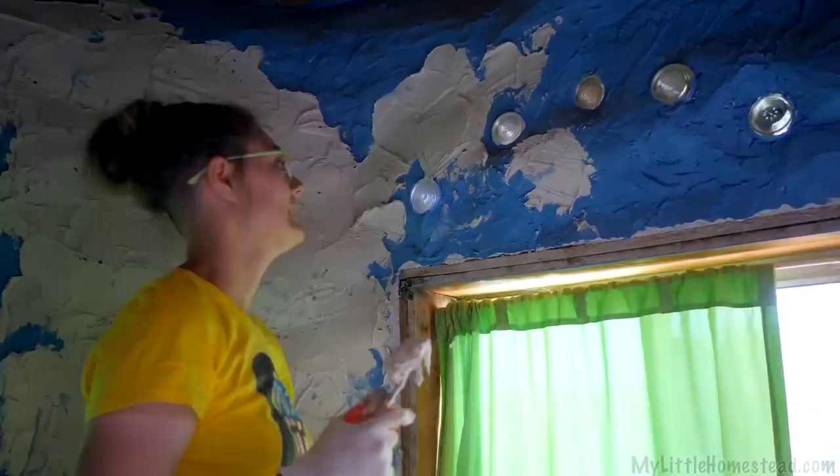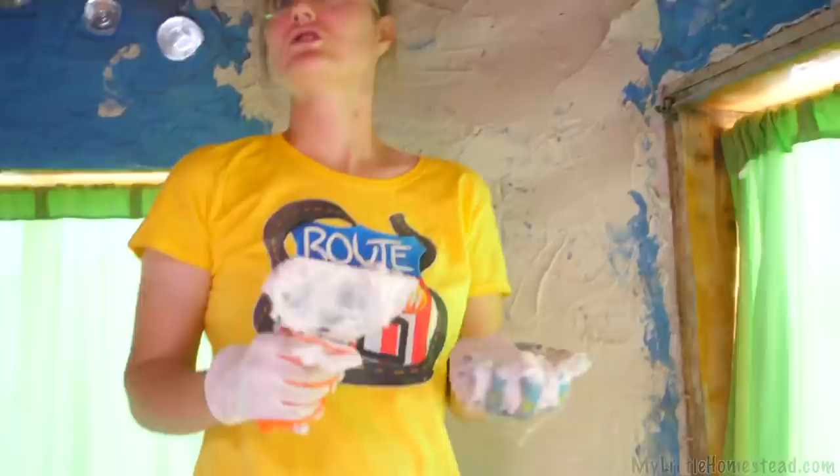You can see this is our first ever stucco job. We did it with lime and stuff — experimenting with our first chunk. It was put up to the very best of our abilities, but I've noticed over time a little too much texture. So we're going through with our sheetrock mud method that we love. We are smearing the sheetrock over it, and then Mom comes behind with a wet paintbrush and smooths it over. It'll create a really nice, easy to paint, easy to clean surface. We have a lot of the white on there — we're over halfway, wouldn't you say, Mom?